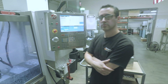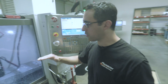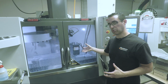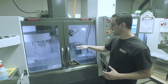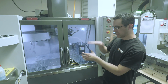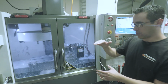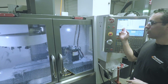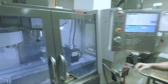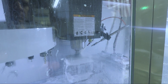And how do you do your tool heights again, since you don't have a probe? All the tool heights that we do, we program off the center line of the rotary table itself. With gauge blocks, we'll touch off some height, and then we know from the top of the gauge block to the center line of the rotary indexer, and we'll just put that in. So if you look at how deep things are going in Z, it makes no sense because it's some arbitrary positive number.